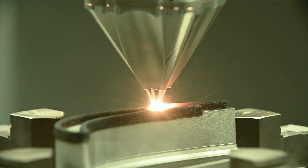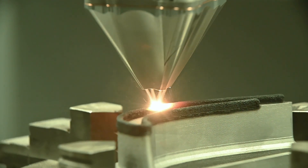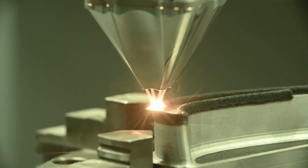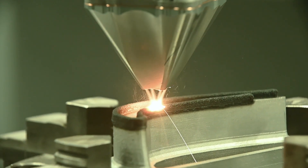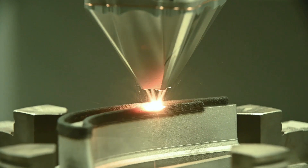That's exactly what it is. With DED we're actually using the same laser technology that we have on the 3D lasers and we're firing the powder at the focal point of the laser on the surface of the material. So rather than firing gas to take material away, you're adding powder to put material on. Simple as that.